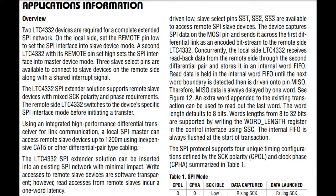There's only one thing you have to watch out for that might affect your firmware programming. If you're only writing from the controller to the peripheral, data transmits transparently. But if you're reading data in - because it has to read the byte and then transmit it - it's going to be one byte behind when it reads data. Data written is done on the clock, but as it reads in it will be delayed. So your firmware, if reading from the SPI interface, will have to drop the first byte, and from then on it'll be synchronized. Just something to watch out for if you are reading data - a lot of sensors don't, but if you do, you might have to change your firmware a little bit.